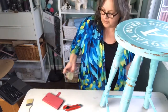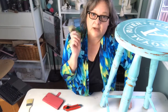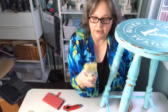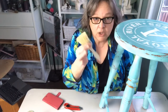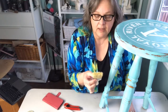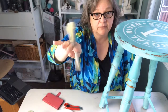Now I'm going to switch brushes. I like to keep three of these: a clear wax brush, a white wax brush, and a dark wax brush, because I don't like mixing my brushes. I'm just going to use this chip brush. If you can't afford to get a proper wax brush, you can use a chip brush — I usually use it only for adding colored waxes, because I'm putting it on and then wiping it off. I use my good brush for the clear and a dollar store chippy brush for this part.